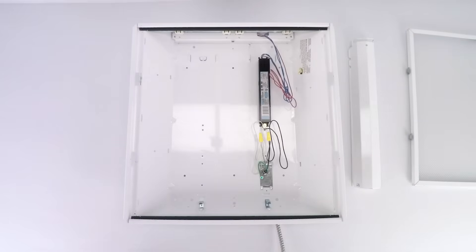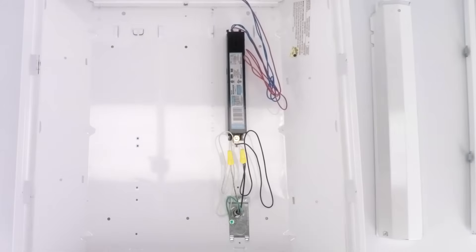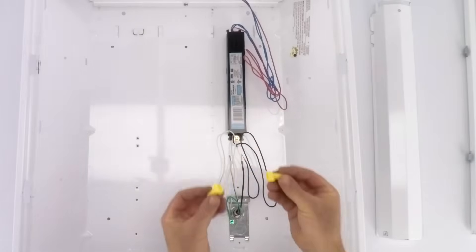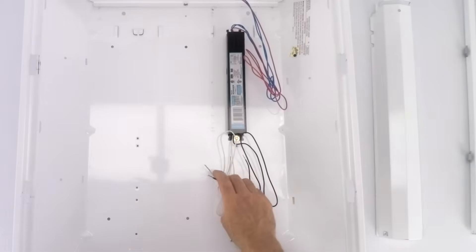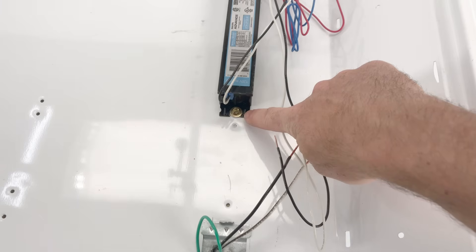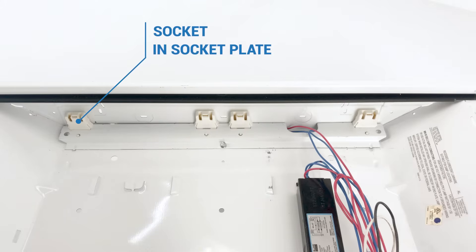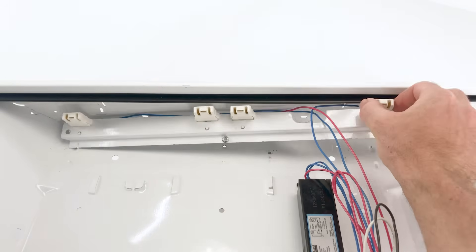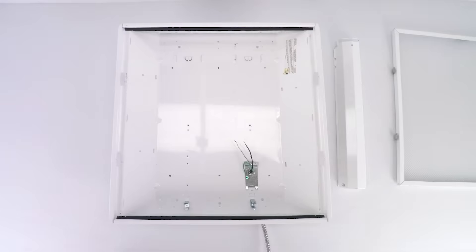Now it's time to take some action. The first thing we want to look at is where does the power come into the light fixture. If there are wire nuts on your white and black wires and the power's off, you can take your wire nuts off now and pull those away. We're going to replace all the ballast and all the wiring — so it's all going to come out. To take the ballast out, there's a nut on one end. Take the nut off, slide the transformer away from the housing, and it'll come off in your hand. The sockets and socket plate come off in pretty much the same way — there's a little nut on one or maybe two ends. Remove the nut and take the entire socket plate out. Now your fixture should look completely empty inside.